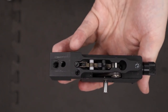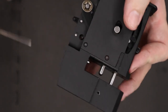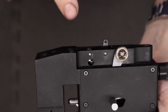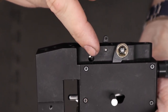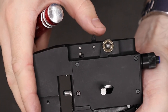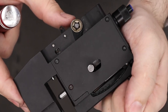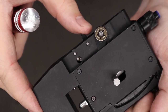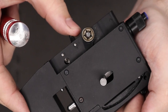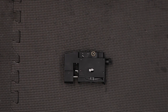The front screw is adjusted with a 2.5mm Allen key; the back one is adjusted with a 2mm Allen key. Screwing in increases sear engagement — we have one sear at the front, the other at the back. Screwing the screw in allows the forward one to move further in, so in effect the sear allows it to rotate further around, causing a longer second stage. You want a nice short second stage but it doesn't want to be dangerous. We're going to adjust that out slightly until we get a very small amount of sear engagement but not so small that it's dangerous. It's a very nice trigger at the moment with a small amount of sear engagement but enough not to have the rifle go off without warning.